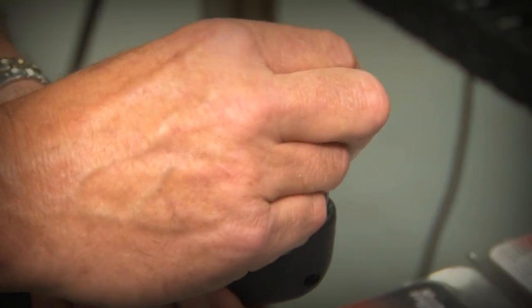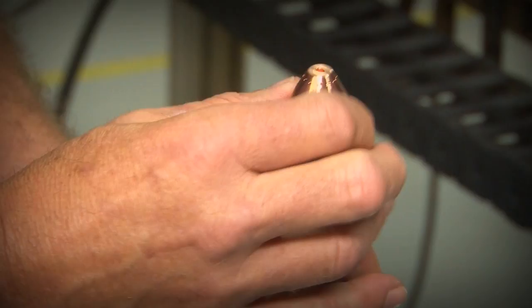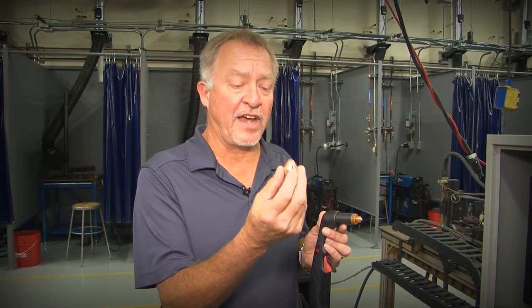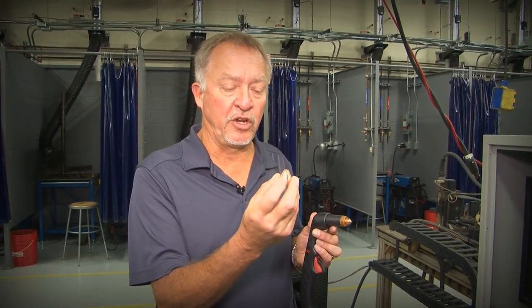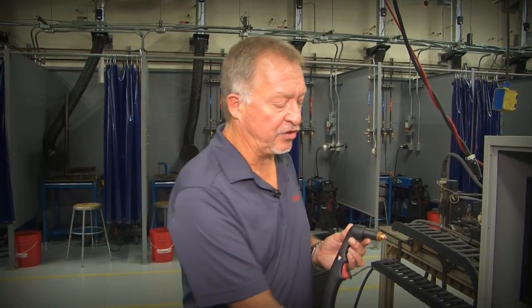The very first part on the front end of a Hypertherm torch is called a shield. Not all plasma torches are shielded, so some don't have this part. What the shield actually does is give you electrical isolation. So with a hand torch, you can drag the torch right on the plate without double arcing the nozzle. A non-shielded torch has the nozzle exposed, so you have to hold a standoff — if the nozzle touches the plate, it's going to arc to the plate, causing much more rapid wear. The hand torch shield is a little longer and holds the correct standoff for drag cutting, which is a heck of a lot easier than standoff cutting.